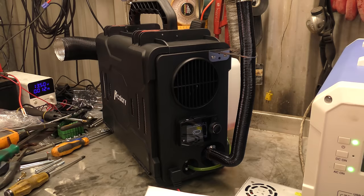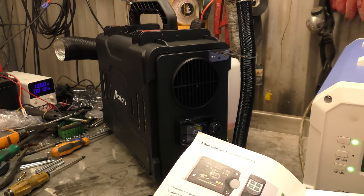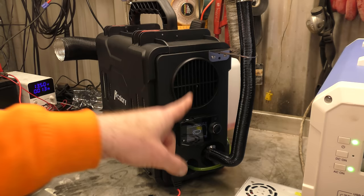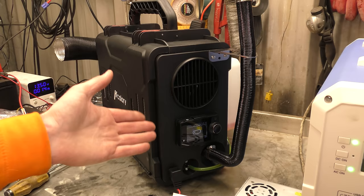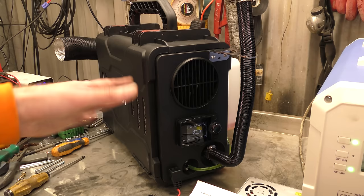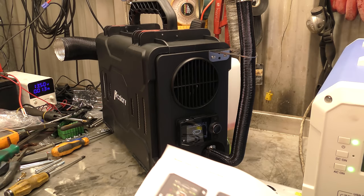There are a couple of interesting things the heater does. It's got an auto start time and how long it runs for during that start time. There's a setting where you can tell it you've filled the fuel tank - you can specify if you've got a 5, 10 or 15 litre fuel tank. You can also tell it the size of the fuel pump, and once you've told it that, it should be able to work out how much fuel it's used and shut down before the tank runs out. We don't sadly have time to test that at the moment.